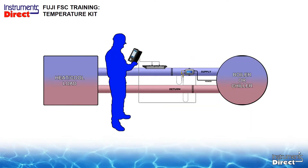For most of you, your logging application is done, unless you want to monitor energy BTU applications. In that case, we will need to go through a setup process for the energy parameters. If you have a BTU energy application, the setup is slightly different — we're still monitoring flow with the flow meter, and we've added non-contact temperature measurement.